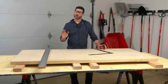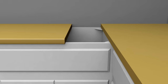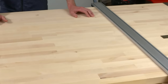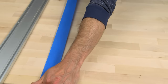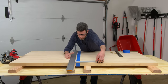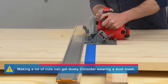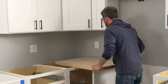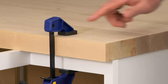Now it's time to cut our butcher block. We're going to cut our pieces one at a time and check the fit after each cut. Our countertops have an eased edge — at the joints I'll cut off this rounded edge to create flat seams. Since our corner cabinet is a little bit deeper than the standard countertop depth, I'll cut down a larger kitchen island piece to fit. Mark the length on top and use a saw guide to create a straight cut. Apply painter's tape before cutting to prevent the wood from chipping. Measure the distance from the saw shoe to the side of the blade and transfer that to the butcher block — the blade should cut into the excess side of the line. Secure the guide to the top, start the saw, and make the cut. Set the corner piece in place and make sure the front edge is where you want it. Clamp it if possible.